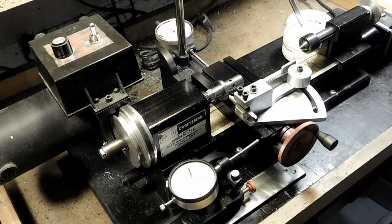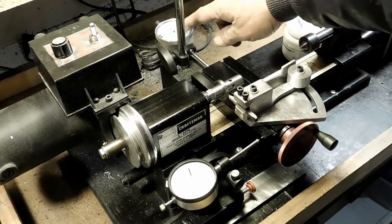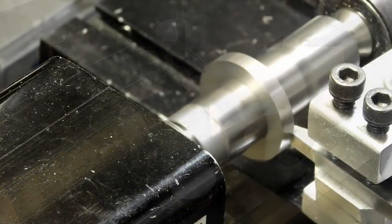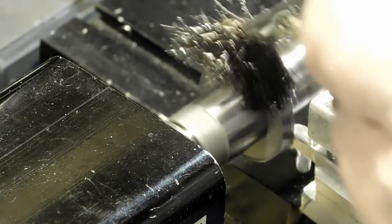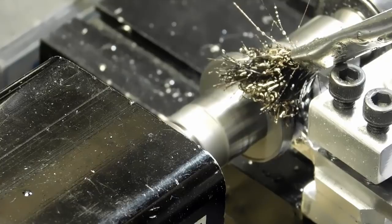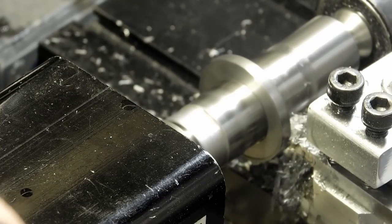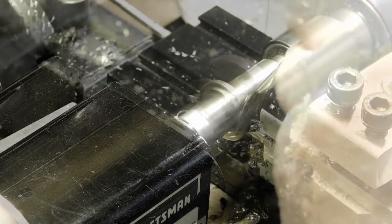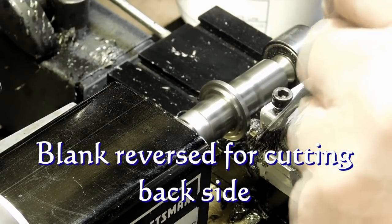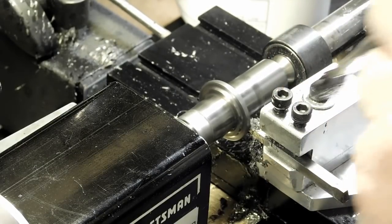I'm all set up and ready to go. I've got my sine bar tool in position, the gibs are all nice and tight, and I've got dial indicators at either side to keep my measuring very precise. I'm doing a voiceover on this process because I wanted to explain what I was doing. I've got the RPM up really high — much higher than I would like — so it wouldn't stall out on me. When I start making my plunge cut it gets kind of hot and squeaks a little bit, but as you get near the destination, that last few thou goes nice and slow. Then I reverse the cutter in the other direction and cut the back side the same way — plenty of oil, keeping the RPM up, cutting slow for that last few thou.